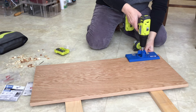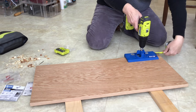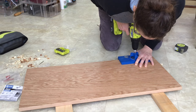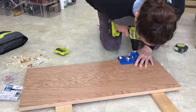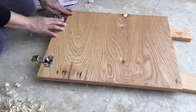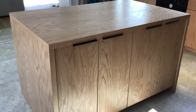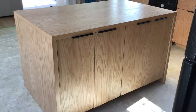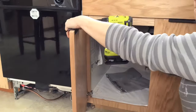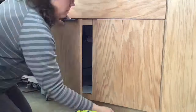I accidentally deleted the videos of me installing the hinges and doors onto my kitchen island cabinets and installing the door pulls, but I did it exactly the same way as last year when I made new doors for the rest of my kitchen cabinets. I followed the directions on the package of concealed hinges. Using my Kreg Concealed Hinge Jig, I drilled holes on the inside of my cabinet doors to mount the concealed hinges into, then screwed the hinges onto the doors and installed the doors onto the cabinets. Then I installed black finger-edge cabinet door pulls by lining them up, marking where the screws should go on the back of the door, drilling pilot holes, and screwing the handles on.